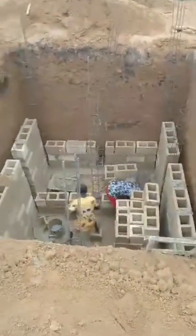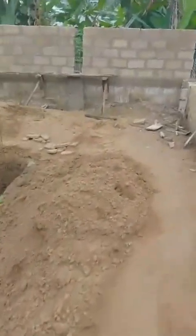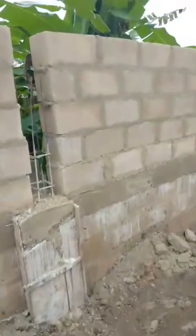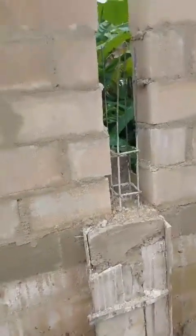This is today's video sent to me from Nigeria. The guys are working on the construction of the soak away. We are using nine inch blocks here. The sand you've seen there is going to be used to fill up the building. On the right hand side is the fence that collapsed — we are using nine inch blocks with reinforced rods to repair that fence.